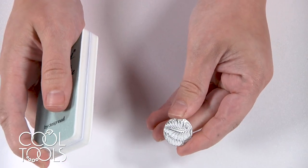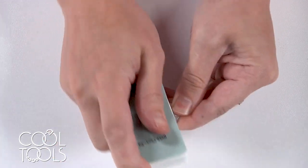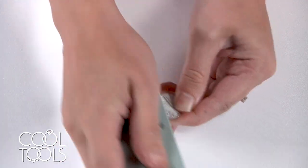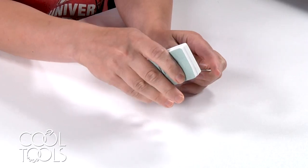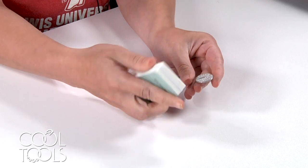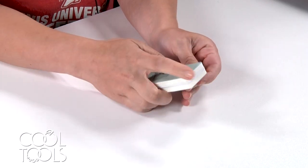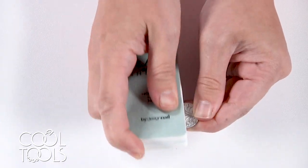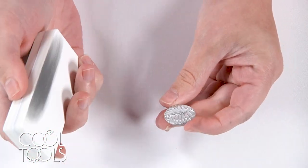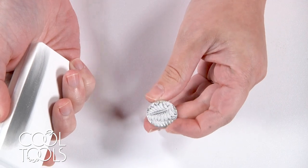You can see that surface really shining up. One of the disadvantages to using this technique is that it is kind of flat and very structured, so it doesn't have a lot of flexibility to get into those low areas. So if you're doing a piece where you've added a patina and want a lot of high contrast, this is a great option and a really accessible way to get a beautiful high polish.